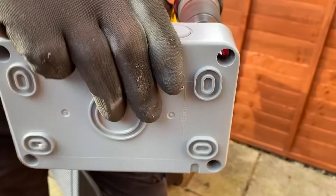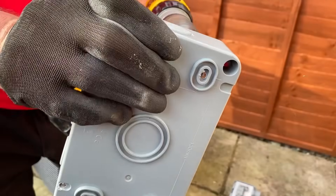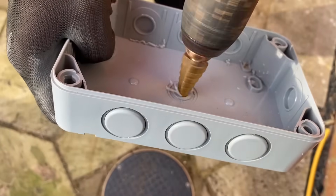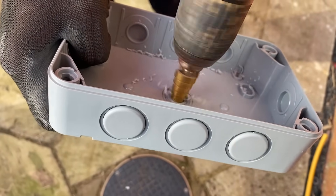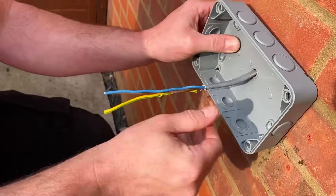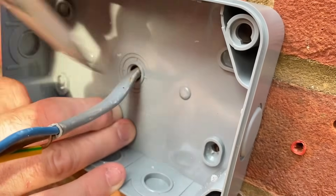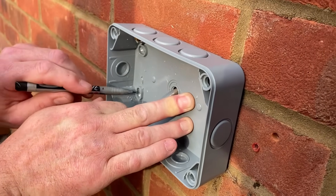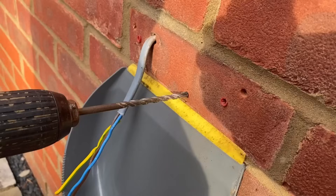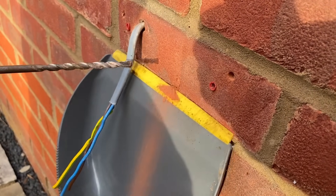I'm going to drill out my four fixing positions. Top tip: try to keep those in the center of the area you can screw through, because it will make it easier to put the little black sealing caps on once fixed to the wall. All four need drilling out in the center. I'm not going to drill a 20mm hole — I want it slightly smaller so the cable comes through quite tightly. Once it's fitted through, I get it level and use a sharpie pen to mark my four fixing positions on the wall.